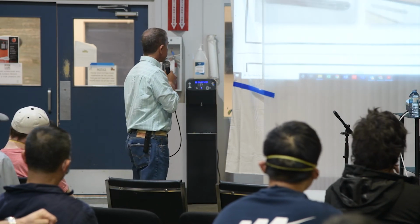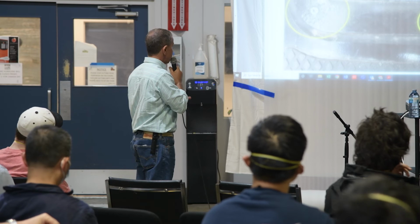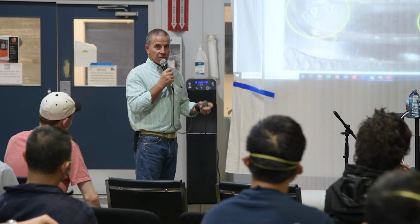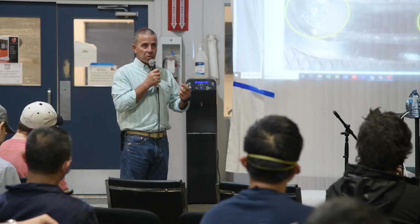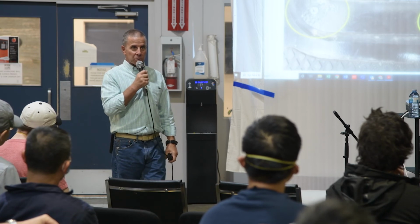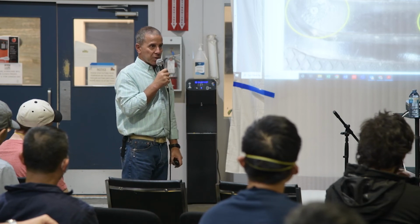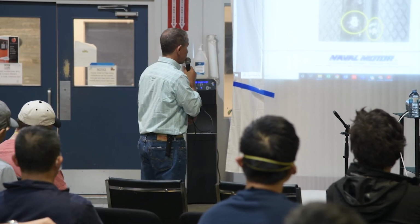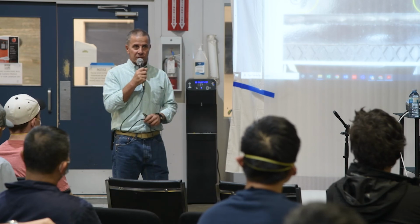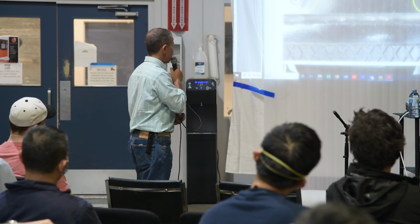I got another one here. That's a case of a recess. That's sort of adding insult to injury. It's a horizontal surface with fasteners going into it. Water is getting trapped, or let's say standing, in those. When it gets wet, if it's salt water, it's evaporating and leaving salt behind. It's a really challenging situation, and not easy to deal with. You're always going to have water getting trapped in those. Bedding the head of that fastener completely is probably your best hope to extend the life of that coating.